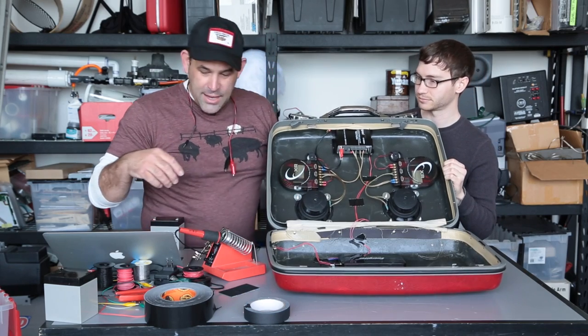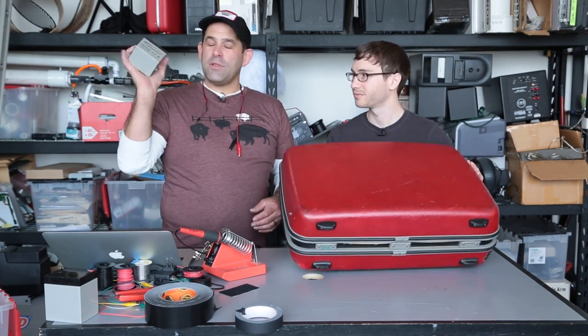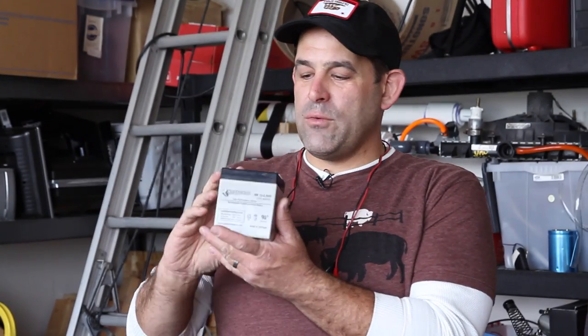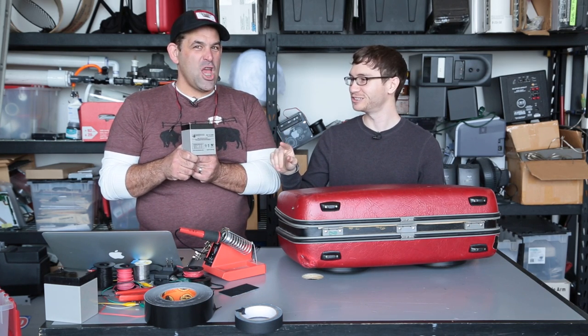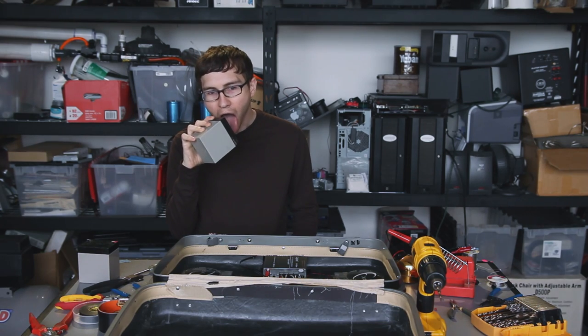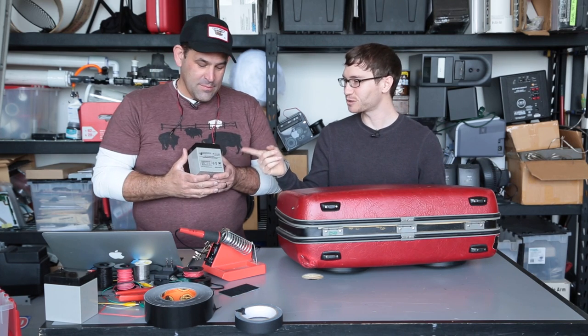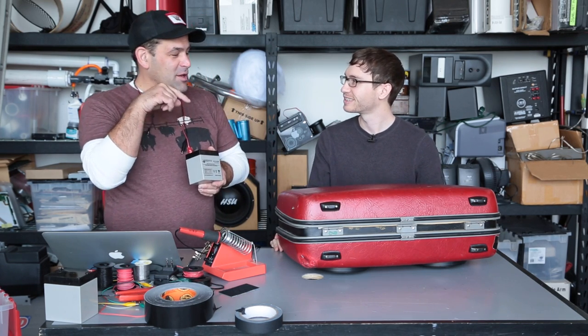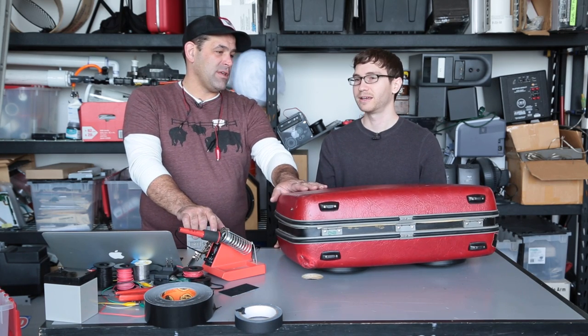Then we got serious about power. We went through some evolutions on this. I started out with a sealed lead acid battery — they're inexpensive, they're everywhere, they are sealed so they don't leak fluid. But I didn't want to go with that for two reasons. One, I have an irrational fear of sealed lead acid batteries. Also, they take a really long time to charge, and the one we had was long past its freshness date. They also generate heat, and we're not thrilled about a lot of heat inside this case.